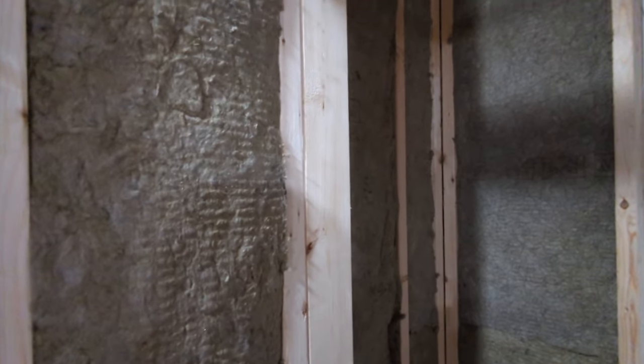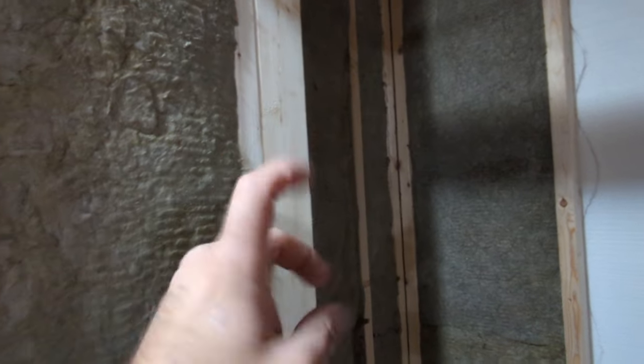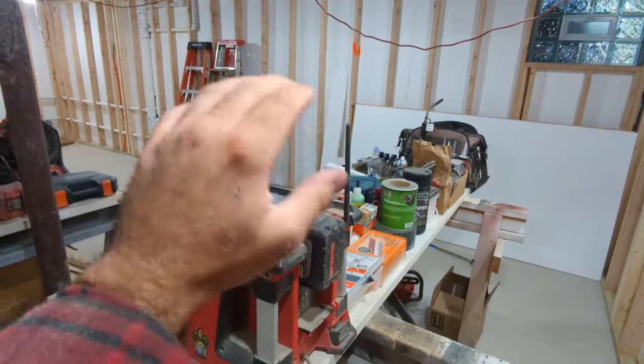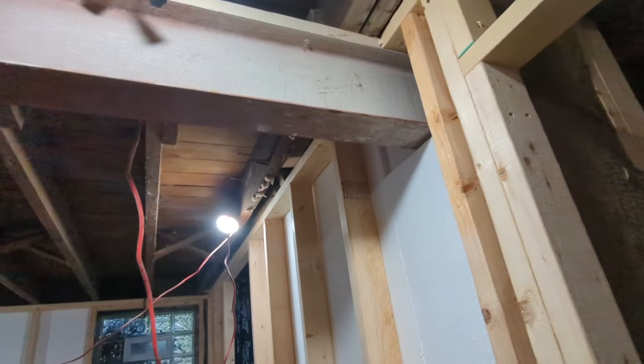Or they may say, you know, here's a little pump and it just goes zoop outside. But then it's like, where does it go outside? You know, it is just condensate, but still. Then it's a little hole where, when you're not using the machine all summer, the mud dauber builds his nest in it. And then the next season, you have a service call because they come out and poke at the little condensate tube that's all jammed up with wasp nest. That's the type of thing. Why don't we just take a little bit of time, put it into the sewer, and we'll see ya. So I think that's what we're doing.